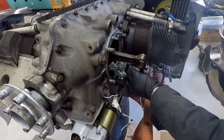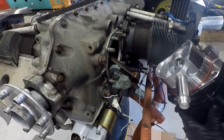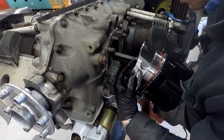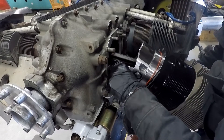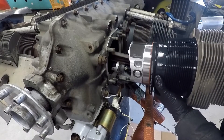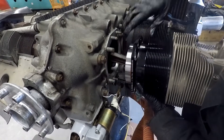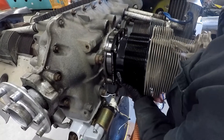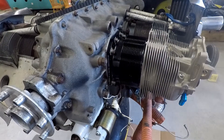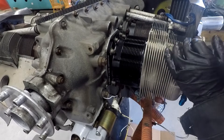Obviously we want to have a good look around, make sure we haven't got anything we're leaving behind that shouldn't be inside the engine. Get the piston pin pulled out of the way, hold up the connecting rod, piston pin pushed through. All of our rags out or on the floor. Gasket is on. Square everything up, a little bit of even pressure — sometimes you can just start it off by just squeezing. Down and on. Now we go through and do our torque sequence. We've got to pre-lube the threads before we tighten things down, follow the torque pattern and torque amounts on the engine.